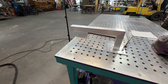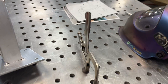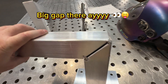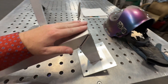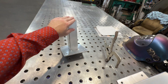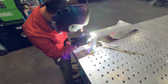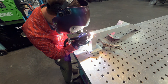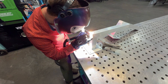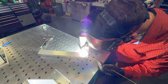One was a little bit longer — a quarter inch — so I'll just chop that off in the saw when I'm done. Wipe your marker marks off too. Now get ready to start welding. One last thing: on your corners where it's sharp like that, a nice sharp fit-up — I like to take the grinder and just knock a little flat on it. That way if they want to grind the welds down they can, and you'll have penetration and structural strength in there. If they grind that weld down without a flat, it's really easy for it to break.